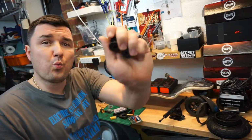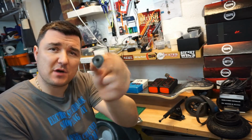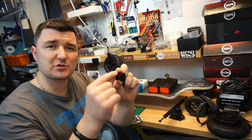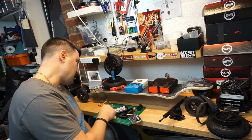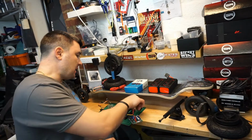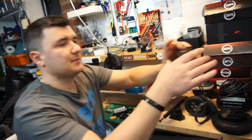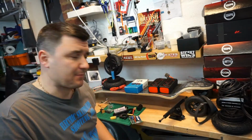So with the motor pulleys, because these have the key slot, pretty much the slot that stops the pulley from spinning around, I don't really like the grub screws. They break, they come loose. I hate those things. So what you will need is 2 little tiny keys. These keys do slide into the motor shaft slot. I will cover the motors and the keys in a separate video.